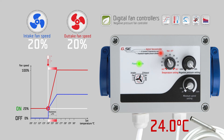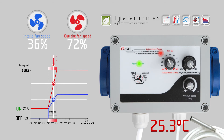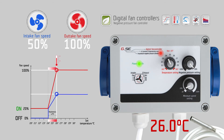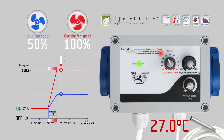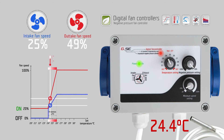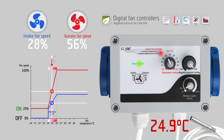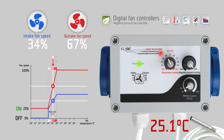When the temperature rises and exceeds twenty-four degrees Celsius, the fan speed starts to increase according to the temperature over the next two degrees Celsius, up to one hundred percent fan speed at twenty-six degrees Celsius. As fan speed increases, more fresh and cold air circulates in the room, the measured temperature decreases, and the fans slow down. We call this auto-balancing of the airflow according to the temperature.